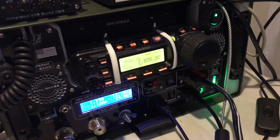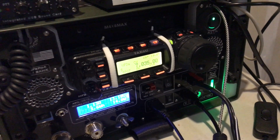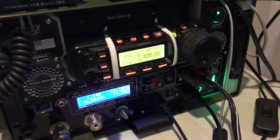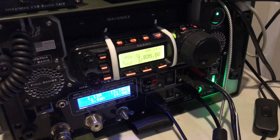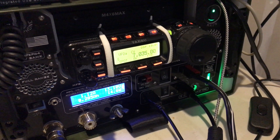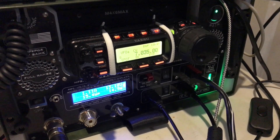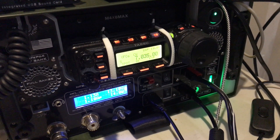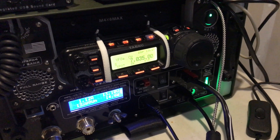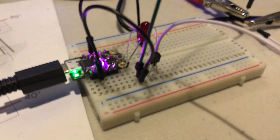The radio is set to about 70 watts so I don't really want to do that. If you're wondering what it's sending — if your CW isn't that great — I programmed it to 18 words per minute and it's sending VVV DE AD6DM slash B CM98HB, which is testing from Dennis AD6DM and my Maidenhead grid location CM98HB.